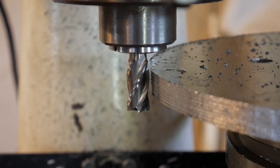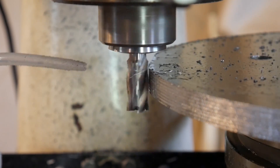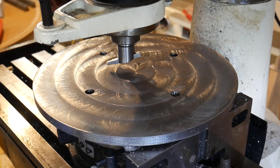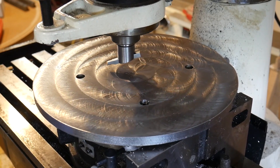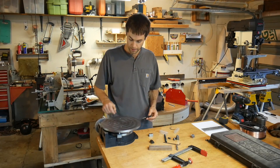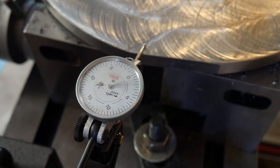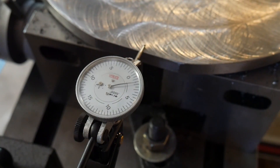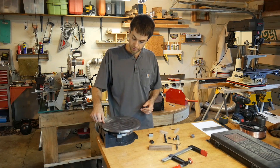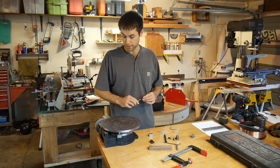After we got it all milled off, I cleaned up the edge with a regular end mill and filed down the edges — it looked pretty good. I tried face milling on the surface but that didn't work particularly well, so I gave up on that and fly cut the entire thing as carefully as I could. I threw a test indicator on it and it came out with a range of about 8 thousandths from the highest to the lowest point. 8 thousandths over 8 inches is good enough for me — if I'm going to do anything special I'll indicate it in anyway.